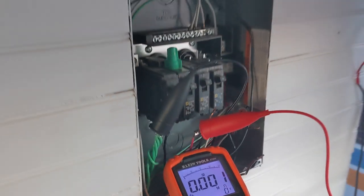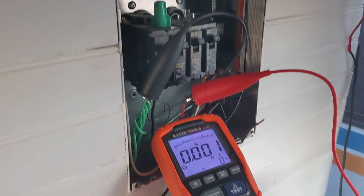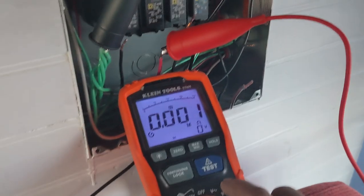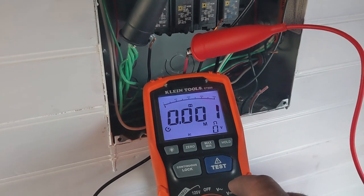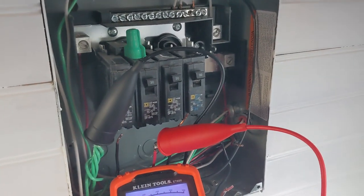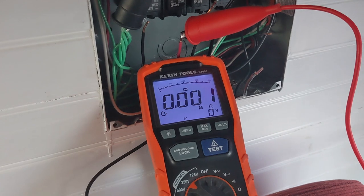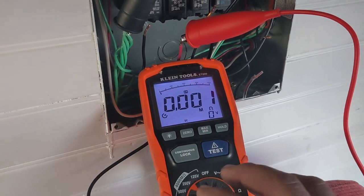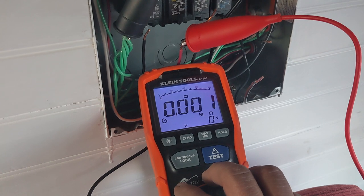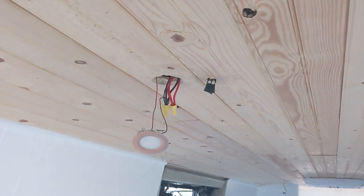Basically we're going to have to pull this panel out and redo it. I feel bad for them. But I want to show you what you can test — you can have this test done if you're concerned about the integrity of the wiring in your bus, if you've got breakers that are tripping, if you're getting zapped anywhere. You want to do a megger test, a megaohm test, also known as an insulation test, and check the wiring. Be safe out there. I'll do another video when I bring the bore scope up and poke it into the ceiling to show you what's going on up there.